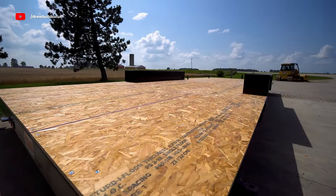With siding, you also don't nail it completely tight. With these trim pieces, I'm nailing them so that there's just the ever so slightest amount of play in them. And you should be able to wiggle it a little bit underneath every single nail head. You don't want to nail anything tight with siding because it contracts and expands with the heat, so you always want a little bit of room for it to move with these trim pieces.